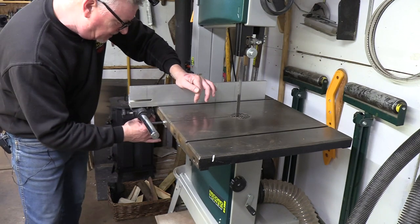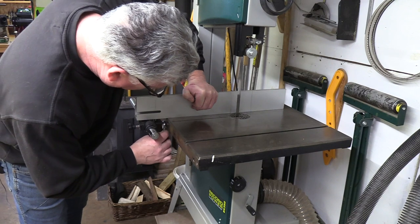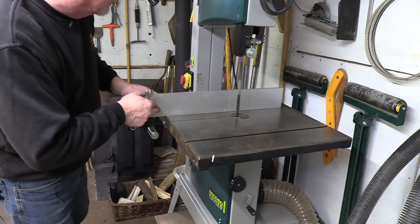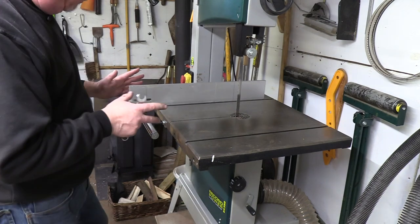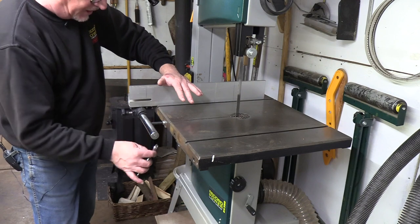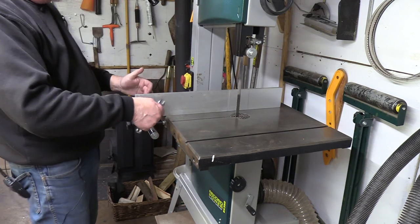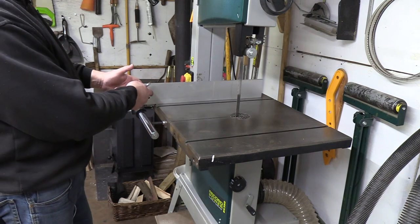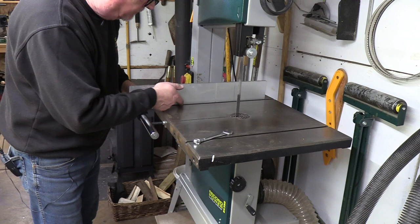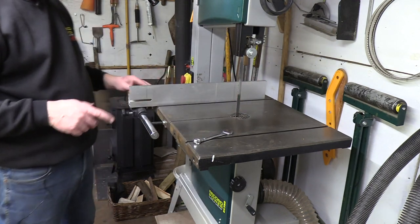So gently pinch that one up, move it across, and pinch that one up. Now that might need doing a few times until you get it right. But bear in mind, put the pressure on there, pinch that up, follow it across, pinch that up. So I've leveled the studs, and I've got my action across there. And I'm just looking to say, to be parallel off that T-slot, with a very, very slight negative on that side.